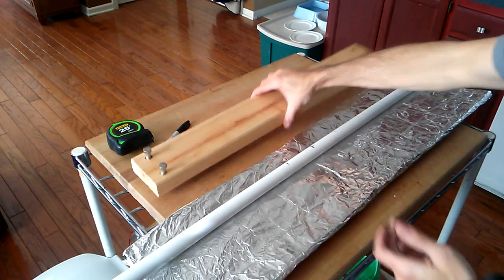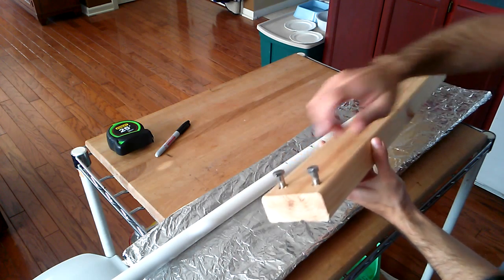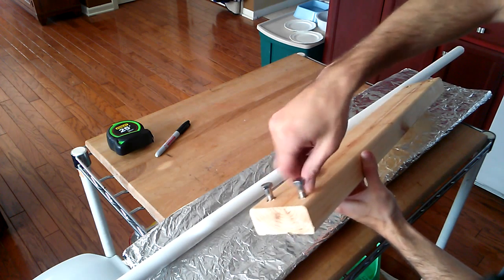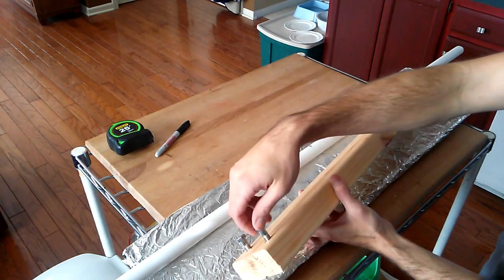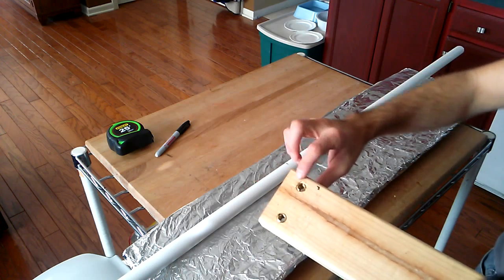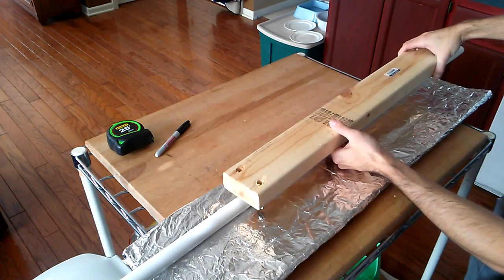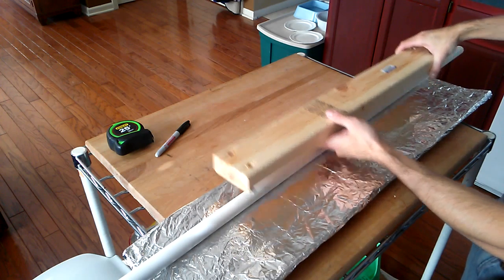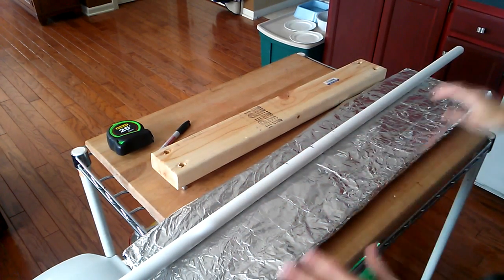And actually, this is my precision jig. I don't use the screws when I'm indoors, but I can make it taller, shorter, however I like, to exactly the right size, so then I can control the taper. I even have, over here, places where I can put bolts in on the other side if I want to leave it not completely flat on the other side. Say if you're going to insert siyahs or something like that, this can make a better transition.